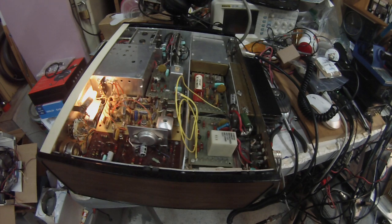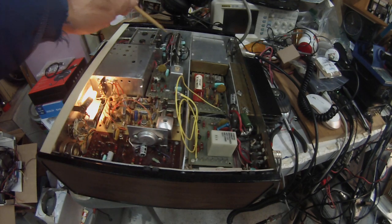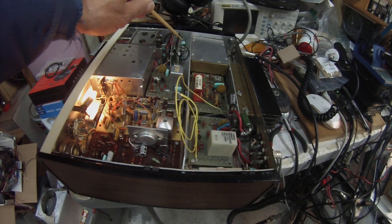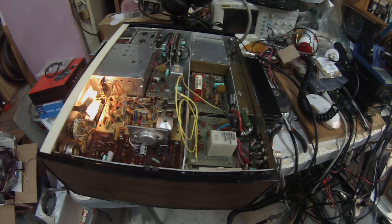The 9 MHz is the generation frequency here in the filter. You take the LO — 16 minus 9 is 7 — so it comes out of this board at 7 MHz. This is just an illustrative example; I may have the frequencies slightly off. We mix the LO and the IF signal and come out with a resultant frequency of 7 MHz on 40 meters. That signal then passes through a bandpass filter.